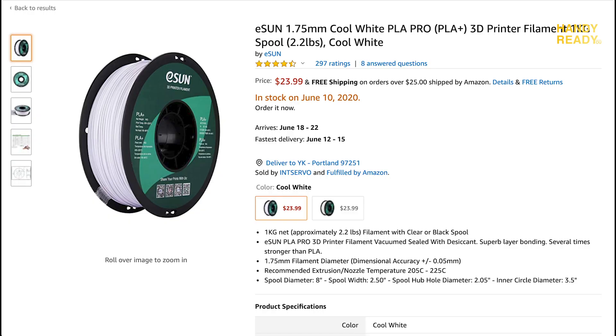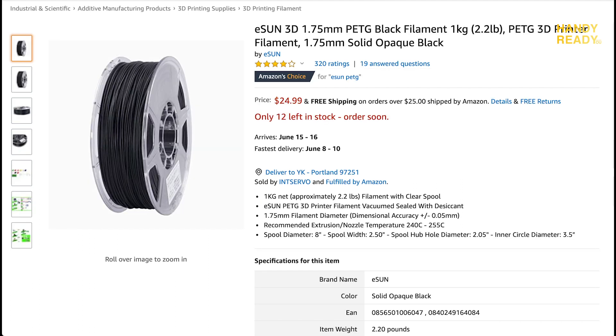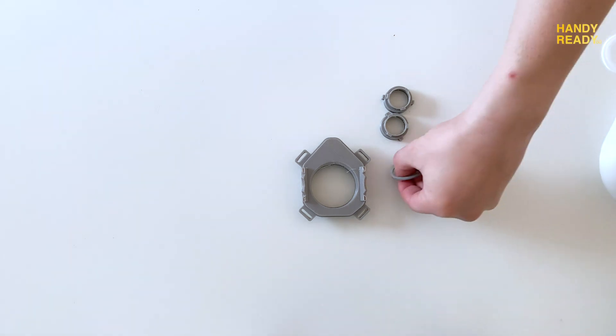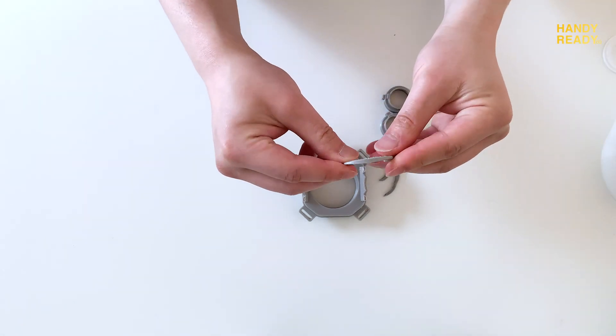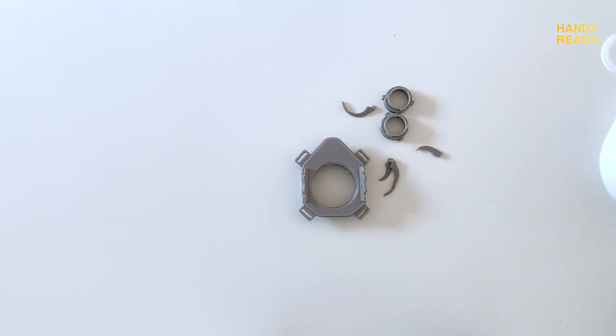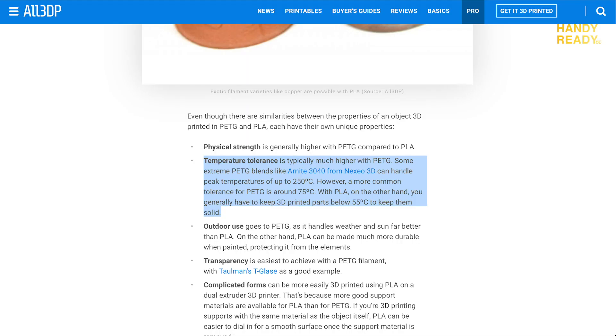As to the core and adapter, I've picked PLA as it is quite handy to most. I've also tried printing it with PETG, but I've found that printing in PETG requires much higher infills or else it can snap easily, especially on small fine prints. Of course, if you have the time, PETG does yield better durability, especially under heat as the heat tolerance is much higher. Either way, both materials should work fine — it is just a matter of personal preference and availability.